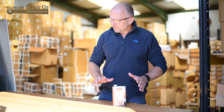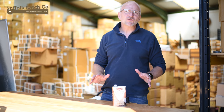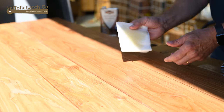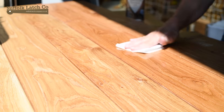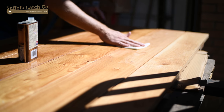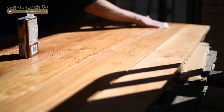We've applied one coat now to both sides of the door, it's thoroughly soaked in and will dry almost immediately for this first coat. From now on we're going to apply all coats with a little bit of rag — no more brushing on — so it'll be very, very thin layers. Next coat goes on both sides, as thin as you can possibly go, then put it to one side, propped up to get air to both sides, and we're going to leave it overnight. Tomorrow we'll come in with some very fine wet-and-dry just to cut that first layer, and then spend probably the entire day, every two to three hours, applying another thin coat. You'll see as the day goes by, the door will deepen in colour, become richer and far more sealed.